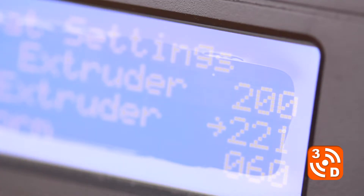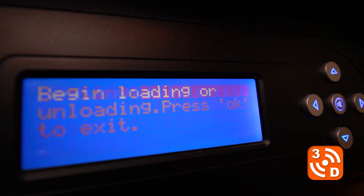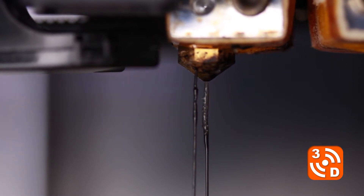To get the best results, heat your extruder up to 5 degrees hotter than the highest temperature you've printed with so far, cut 20 to 30 centimeters of filament, and simply extrude it through the hotend at either a medium speed or whatever your printer's default loading speed is. Once it starts to come through, you'll see it taking on a white spiral shape, and you should be able to notice small particles of your older filaments lodged within.